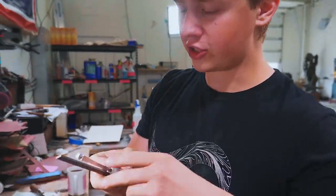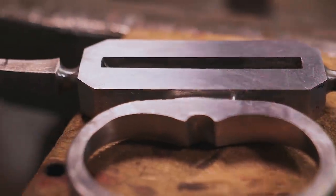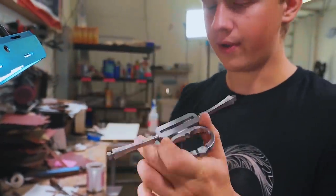So I just said we weren't quite ready for the fun part — I lied. We are ready for the fun part. I'm going to start off by chamfering these edges — that is to create a 45-degree angle to break the 90-degree edge that we have here right now. It's going to be a nice line that'll run all the way around the guard. I'm going to do that all with a hand file before I move on to the rest of the fun processes on this.